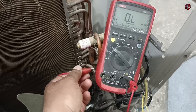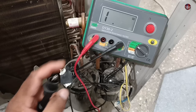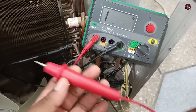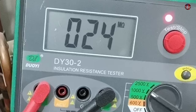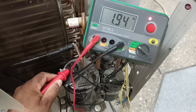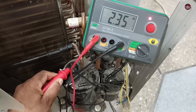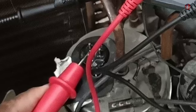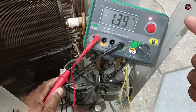This means the compressor could possibly be good, but I will make a final decision after testing with the insulation resistance tester. I will pass 1000 DC volts through the compressor terminals using the Megger, with the negative probe on the pipes. The first terminal showed 1 mega ohm, then changed to 2 giga ohms. Normally, a compressor winding reading above 500 mega ohms is considered good, but because it first showed a low value before rising, I am doubtful. On the next terminal it started at 0.23 mega ohms and then increased — which could be a sign of a bad compressor. I will consider this compressor bad.